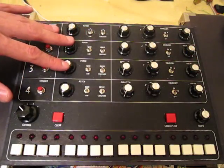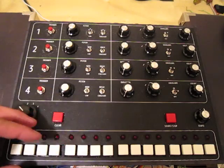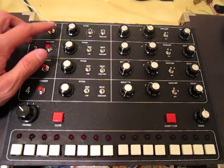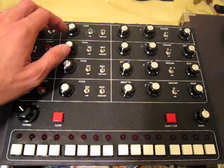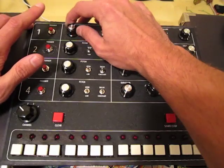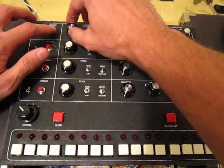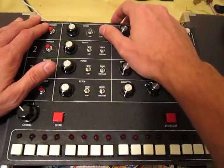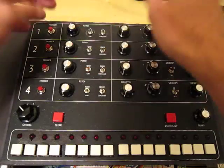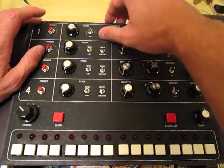These four rows of controls control the different voices, the independent channels. Before we get into any of the programming, I'll demonstrate the kinds of sounds you can make. This button is an asynchronous trigger — it triggers the effect at any time. Next is a pitch knob that controls the pitch. There are two pitch ranges; this was the low range, but this switch lets you put it into a higher range. This switch turns on a pitch decay, so the pitch gets lower as time goes on. This is the sound with it off, and if I turn it on, it sounds like this.